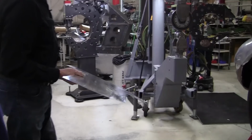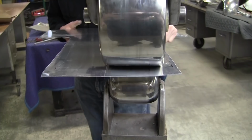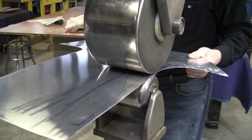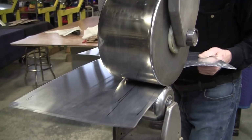So we're going to use this low crown panel. This is my workhorse panel. We painted it big yellow, now it's big gray. I'm not so sure I like the new color, but it's a change. In order to make that metal move, you've got to have enough engagement. I call it the mid-range pressure. And again, if I was an English-trained English wheel guy, I would be all concerned about tracking patterns. I'd be going crazy about making sure that I've got all my tracking patterns really good. I don't care about the tracking patterns at this point. At some point, I probably will use a little bit of the tracking pattern method. But at this point, all I want to do is raise that material up. And you can see I've got an oil can going there already, and that's what I want.